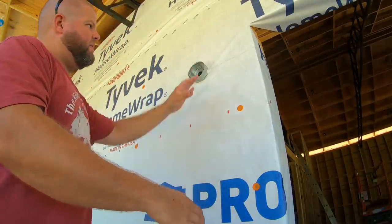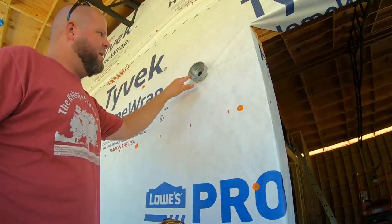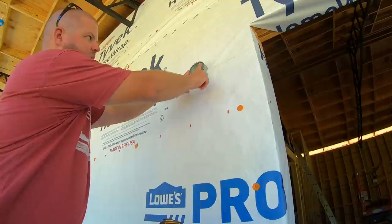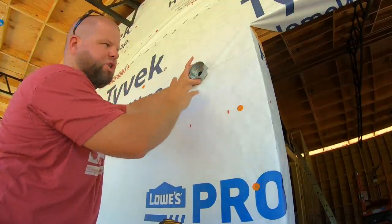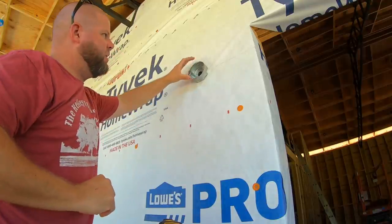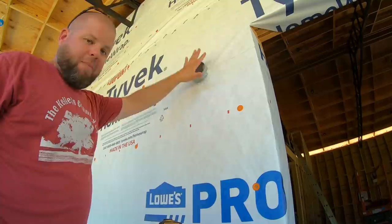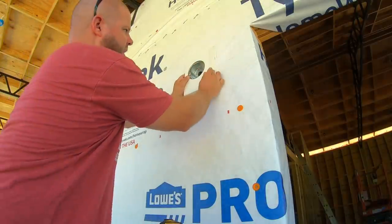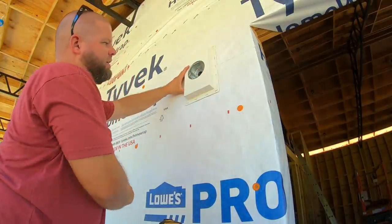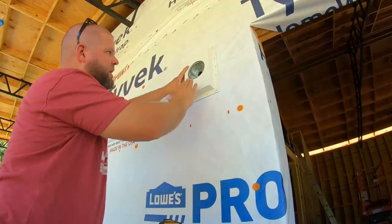All right, so the beautiful thing about this is, now this box is actually heavily screwed to the wall. The light is mounting to this. I noticed the majority of outside lights come with a bracket that bolts right here, and then it's got all kinds of different adjustments in it for centering your light up. But now this is mounted to the wall. The light will not be mounted to the plastic piece. And since we have trimmed the plastic piece out just perfectly, check that out. Now we can seal this to the house, although I don't expect any moisture here.